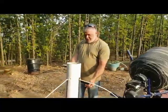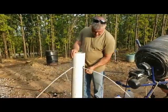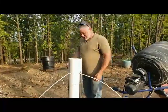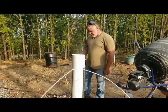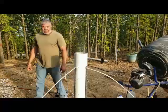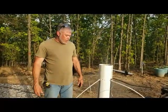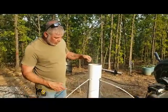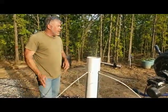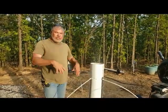I have made a jig — a template — for these pier cages. I just took some PVC, drilled some holes in it, put some zip ties in there to hold the PVC, because I don't have any bands, which is what you typically would tie around piers. Pre-bent rebar. I build this jig and then tie it with wire. Once I get it all tight so it's not going to come apart, separate, or collapse, I will slide this jig out from underneath it and the pier cages go right in the hole.